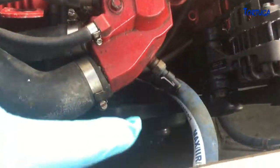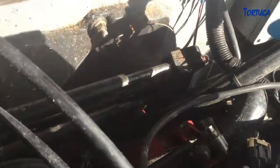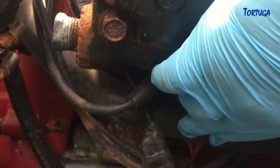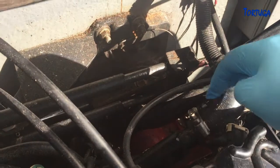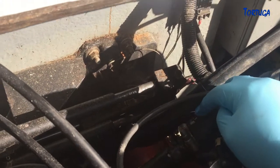First task of the day: the pump is way down there, at the back of the engine. This hose here is the main feed from the drive leg. It goes into the oil cooler and down across the engine. Now this part here is below the water line. So what I intend to do is disconnect this hose from up here, and that way the only water that should be spilling out is what's already in the pipe. We shouldn't actually be getting anything coming in from outside.